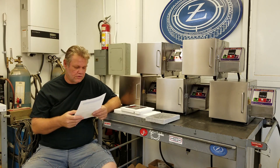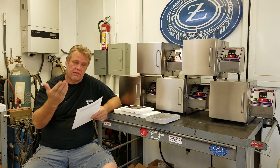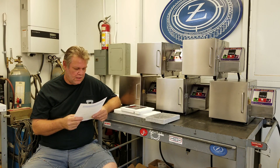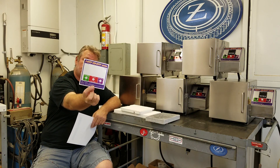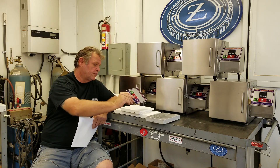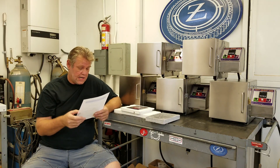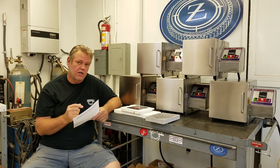It's got a control power switch which drops out all the controls and in turn drops out the element. What it does not drop out is the cooling fan — it has automatic cool down, so as long as it's plugged in, the cooling fan cycles automatically. It's got an easy-to-read nameplate — these are hard anodized on aluminum backs, very nice. The artwork for those is courtesy of James Harrell over at jamesharrelldesign.com.